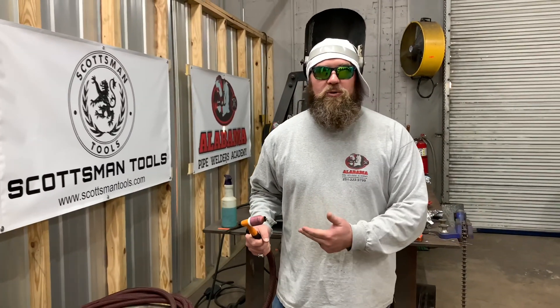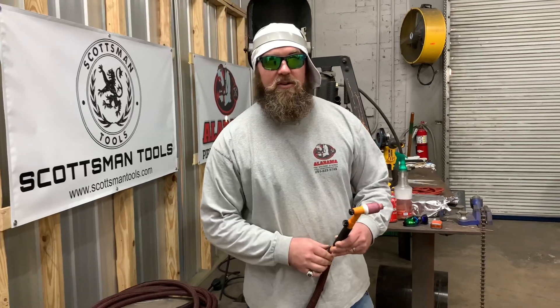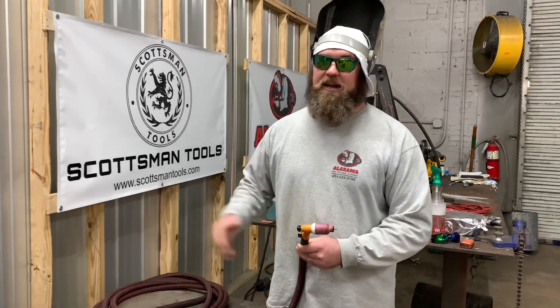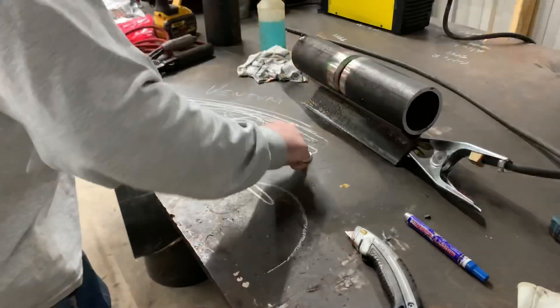The reason why I know this — I run a welding school — I can walk around the school and probably 90% of the students out there have loose connections on the TIG rig and they're not blowing porosity. Anything on your TIG rig — your gas lines, your torch head — they're always loose and leaking. It's easy after you've got porosity to go find a loose connection. 99% of every welder out there probably has a small leak somewhere, and they're just blaming it on that leak.